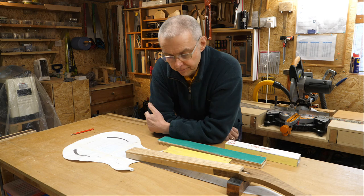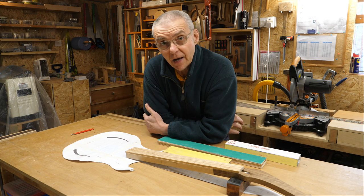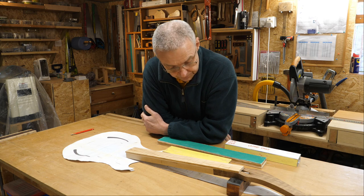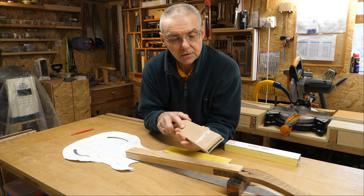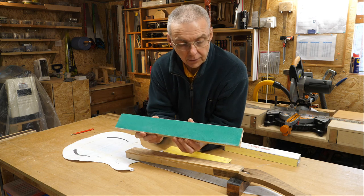Okay, well, I've radiused the fretboard and managed to avoid getting a rash from the olive dust this year. It serves me right for sanding olive in a t-shirt last year. Just to explain how I did it, I've used this homemade radiusing block. It's set to 16 inches. I've got a link in the description below on how I made this.